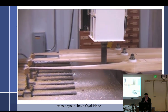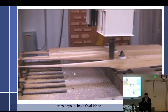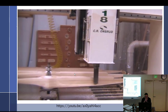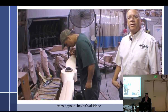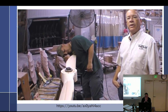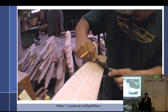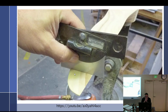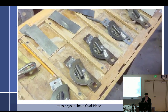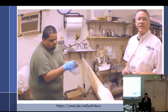After the propeller hubs are milled, all the propellers are mounted onto our CNC router where we profile the blade shape. This can be done one at a time or up to five propellers at a time. Even though the propellers are CNC profiled, they still need hand finishing, so the propellers are hand carved using spoke shaves and sandpaper. We use airfoil templates to maintain template fit and protractors to maintain blade angle. All the while, the propeller must maintain balance and be carved to within a balanced tolerance.